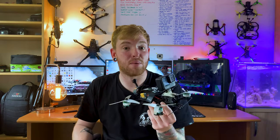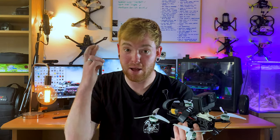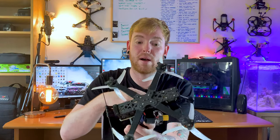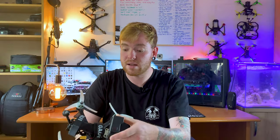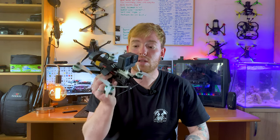I want to be able to land in the water basically. Talking to Brandon on Instagram, this stuff literally blows anything else out of the water. I was actually really surprised by how easy it was to waterproof this drone. Literally all I did was take it all apart, apply the waterproofing to each side of the flight controller, the ESC, and the contacts on the Vista, and then I sealed up the Crossfire. Let's get straight into the build video and see exactly how to waterproof it.